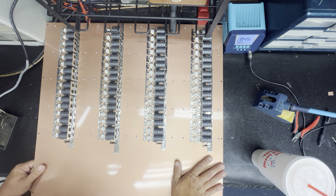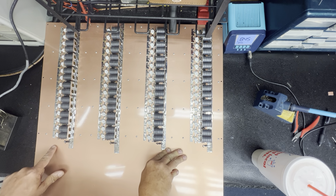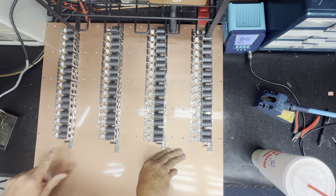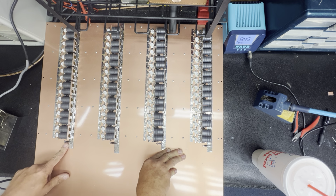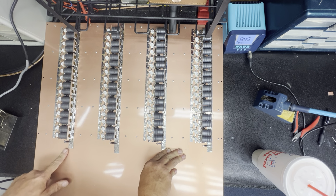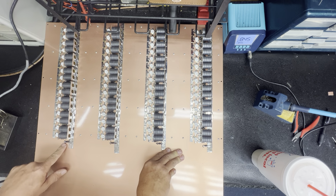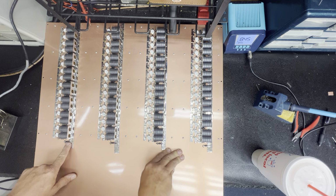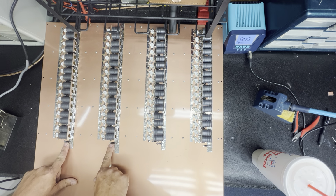Well, the purpose of that diode really is to blow in short and cause the fuse to blow. But it ain't gonna do it on the amp because the fuse is so big. But it don't matter. If it's been hooked up backwards, or even if it ain't hooked up backwards, let's say the amp shorted out for some reason, like something shorted, it'll show me that. So like this diode, if I look at it and it's blown, I know something has been shorted. You see what I mean?